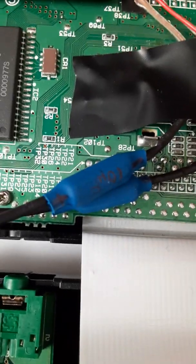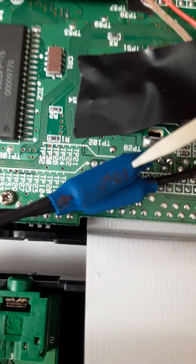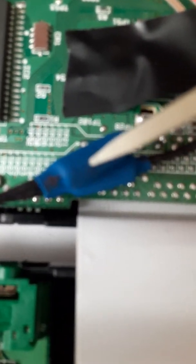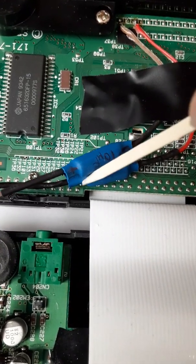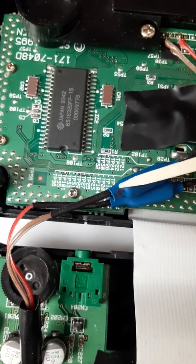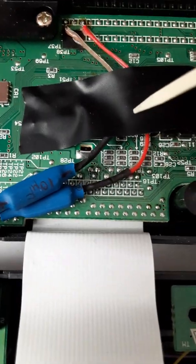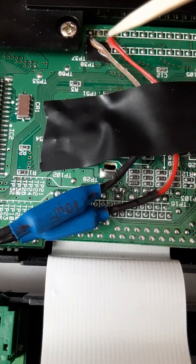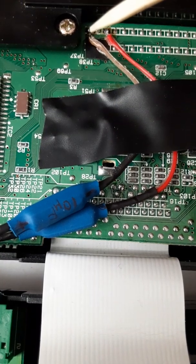The brown wire goes up. These are axial 10 microfarad capacitors — I believe they are 63 volt. That's the positive side. Positive side of the axial capacitors, negative side goes up. The red wire goes to B3 of the cartridge connector. The brown wire goes to B1 of the cartridge connector.